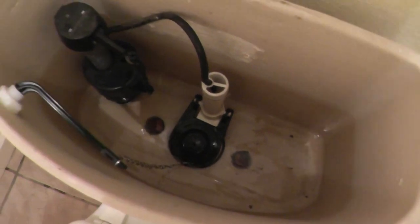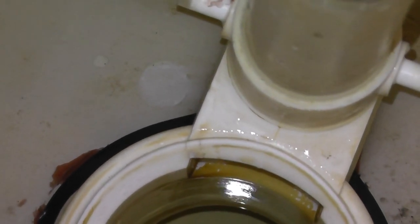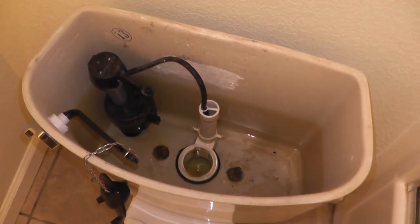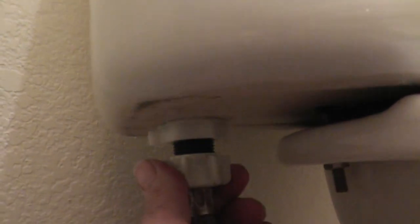The first thing is to shut off the water service to the toilet. I've turned the water off and emptied the tank out by flushing it. Next I'll remove this flapper valve so you can see the problem with that valve seat — there are a couple of very small cracks right here causing water to leak past the flapper valve. Next I'll disconnect the water service to the tank. It's got a handy little connector here that I can just unscrew by hand. Even though the water is off, I'll place a little catch can right here for any excess water.